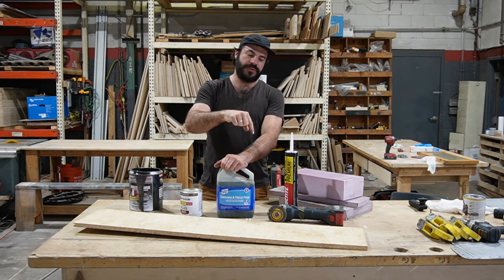Another thing to consider is that when we go to drop these pieces in across the floor here, they've got to be narrow enough to clear the chair rails on each side. So we'll be cutting the pieces just shy of the actual width for the second and top layers that I'm cutting. And that serves another function as well, which is we actually don't want that plywood subfloor material to be physically in contact with the steel chair rails.